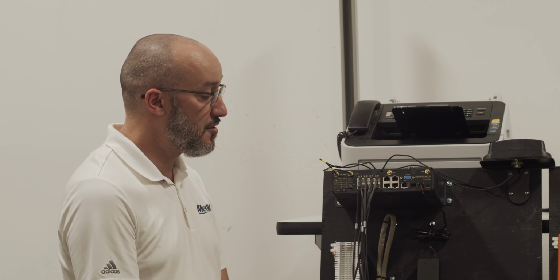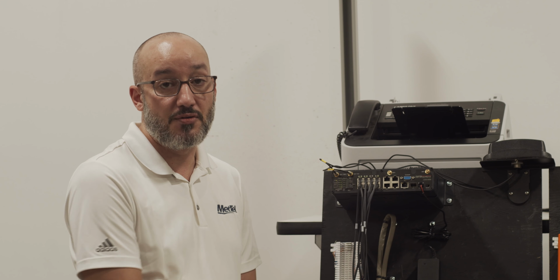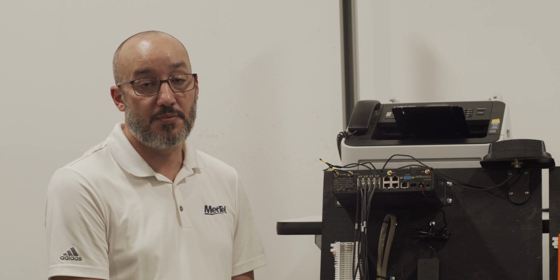Once that first call completes, the 9090 will set itself to the appropriate calling format and the panel will make a second call. After this second call completes, the FXS light should cease blinking. At this point, have your local contact confirm with their central station monitoring company that they received the appropriate signal.